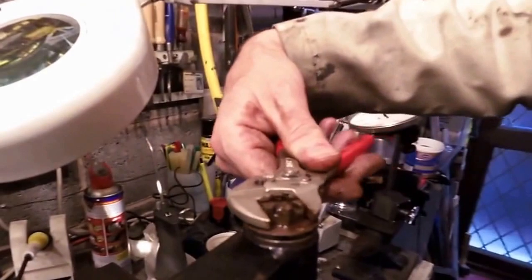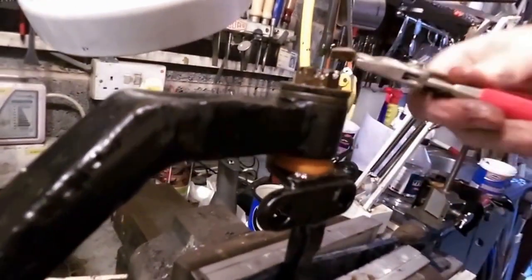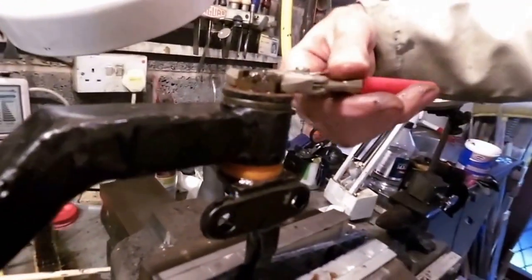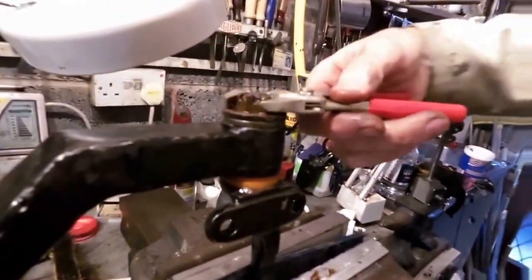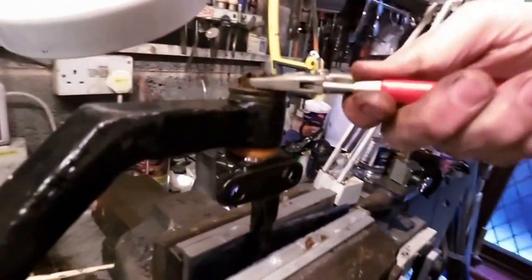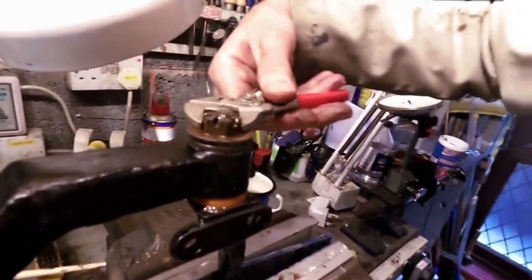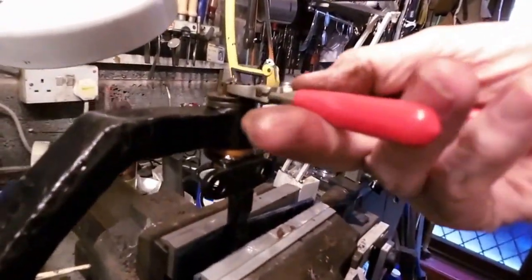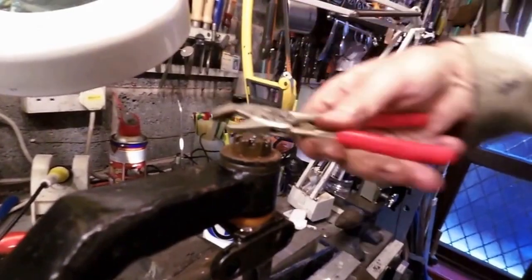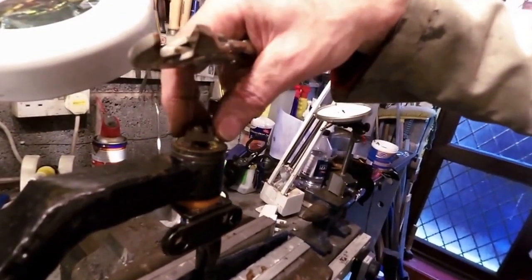I've simply been winding it on using the nut and indeed it seems to be working. I've lubricated the bush on the inside — on the ball of the bush — with copper grease, because that seems to be something that some of the polyurethane bush suppliers actually recommend or supply as their original equipment. On the outer surface of the bush I've put just some soap, to hopefully ease it in but not allow the bush to spin in the wishbone itself.